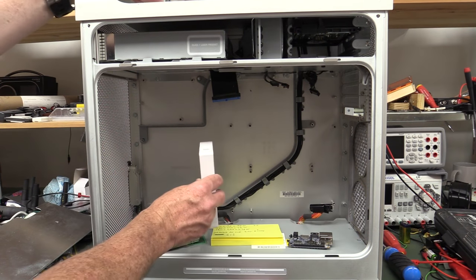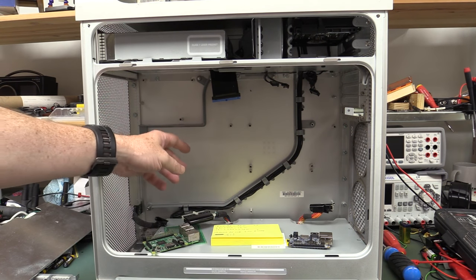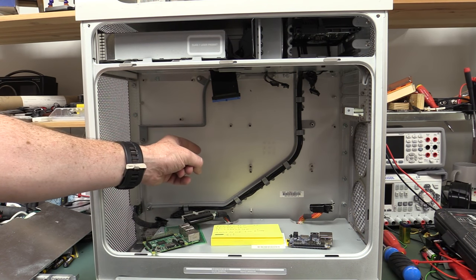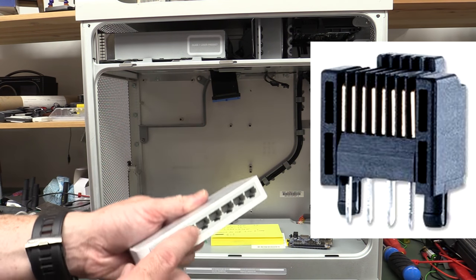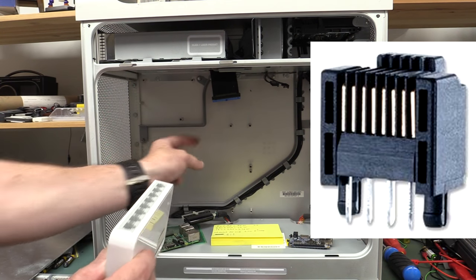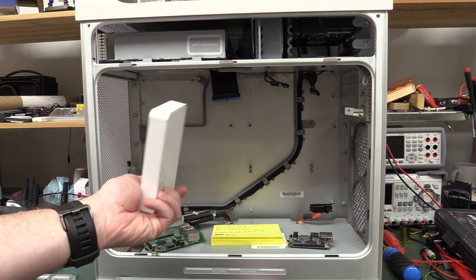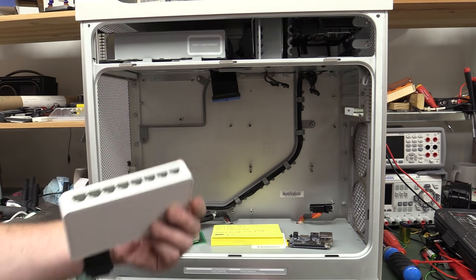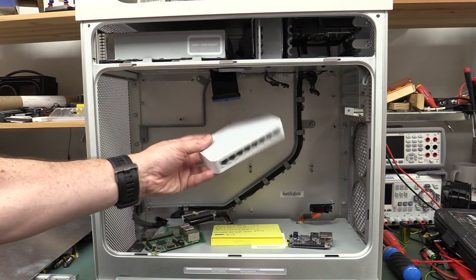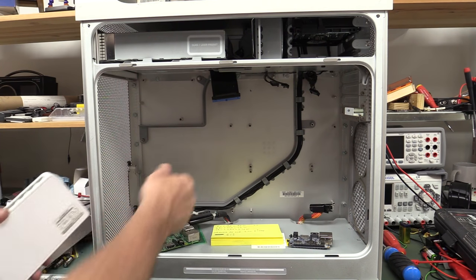In fact, you could even have this as a vertical solution like that, and either have short cables or vertical. Somebody actually pointed out, I thought you couldn't get them, but somebody actually posted a link to one. You can actually get a vertical male RJ45 connector, a PCB mount RJ45 male. So in theory, you could have eight of those on the board and just come along and go click. And in theory, your switch would just click into your motherboard like that, and it wouldn't take up much room. So it's almost a sexy solution to actually do it that way. So, hands up if you think maybe that would be the go, to put those vertical male ones on there.